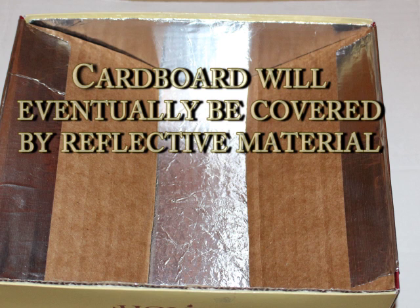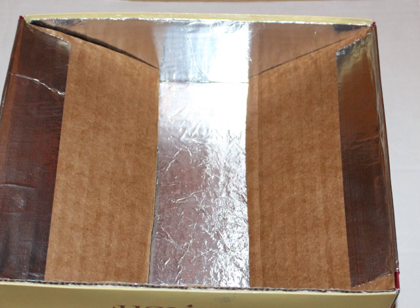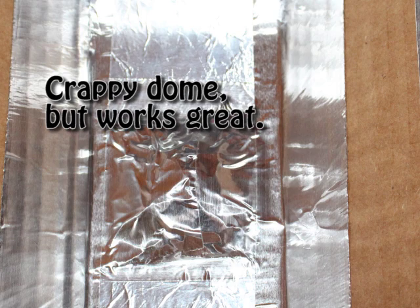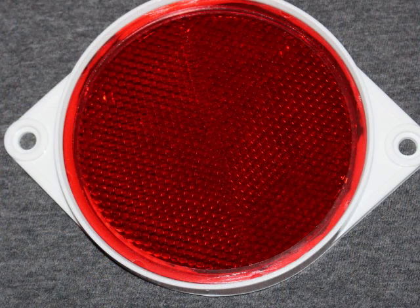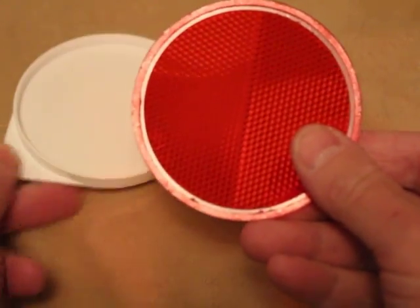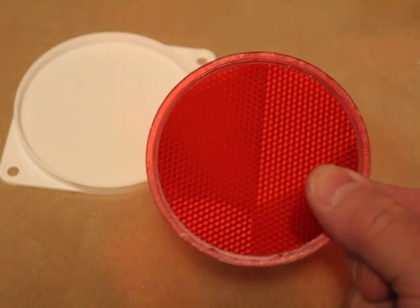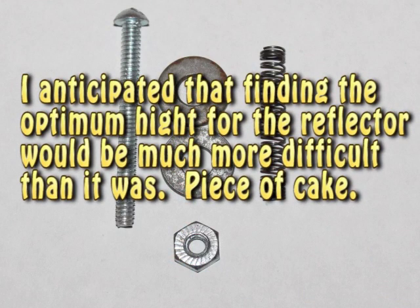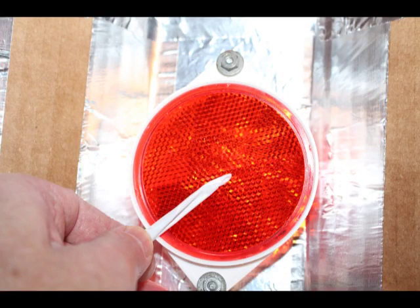What ended up working best for the inside reflective surfaces was to add two pieces of cardboard on roughly a 45-degree angle. This kind of reflects the light out the sides. Another thing that worked very well was to add a dome on the back side to help disperse the light. The bicycle reflector did end up being the best solution, but to maximize its efficiency I had to remove the reflector from the housing, cut away the back side of the housing, and install the reflector upside down so the laser hits it from the reverse side. I over-complicated things by using spring-loaded bolts to mount it — all that was really necessary was to mount the reflector about an inch above the dome.